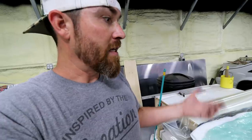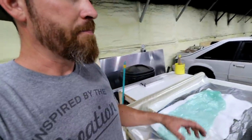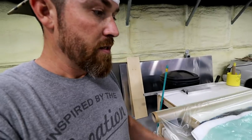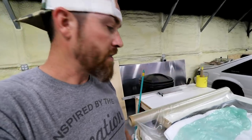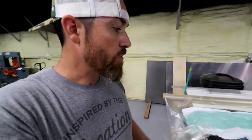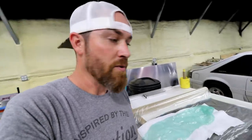And then once you get it done, you basically pull vacuum on it the same way, same kind of materials. You pull vacuum on it, and then you stick it in an oven or an autoclave under vacuum, and you heat cycle that thing, and it cures. So it actually releases the resin to flow and cure it. And that's the way that things are done in the automotive world, is all pre-preg. If you're making wheels or intakes or, you know, Koenigsegg or Ford, any of those guys that are making anything in carbon, they're doing it all in pre-preg. It's really the best way to do it.